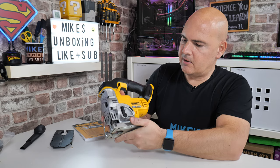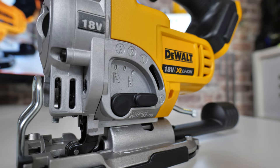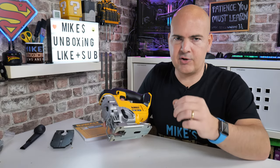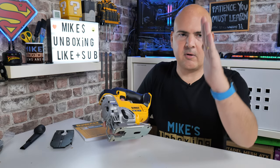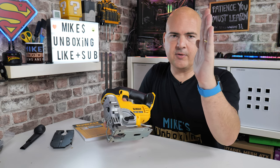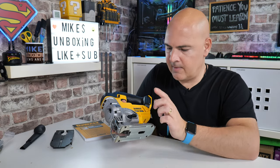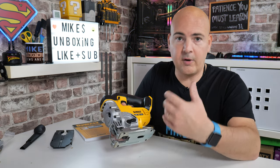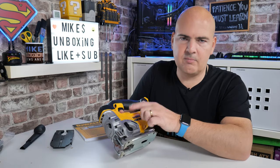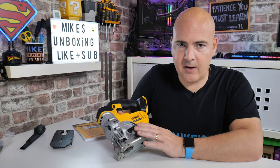On this side you have the pendulum adjustment dial. The pendulum controls a jockey wheel at the bottom — in position three it's loose and free, giving the blade an almost orbital motion so it's not touching the entire surface at the same point. In position zero — the absolute mode — the blade is at exactly 90 degrees, so the full blade surface contacts your material, giving you super clean cuts. For thicker material you can move up to positions one, two, or three; for delicate fine cuts, stick it in absolute mode.